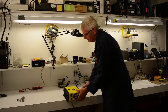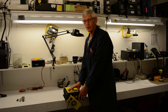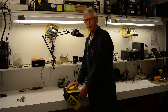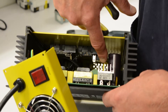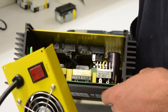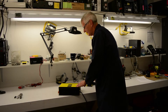This end slides off relatively easily, and the jumper is relatively accessible. When converting from 120 to 230, it's really easy to remove the jumper altogether, so you don't have to remove the top layer and the meters themselves. Here's a close-up of the inside of the larger battery charger. The jumper that has to be removed is this yellow one right here. We don't have to change positions like the small battery charger — we simply remove this jumper. And you're set for 230 volts. It's that easy.